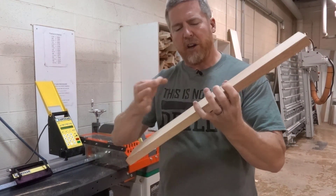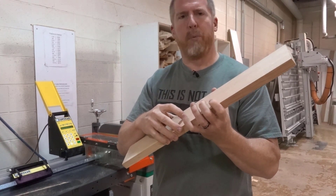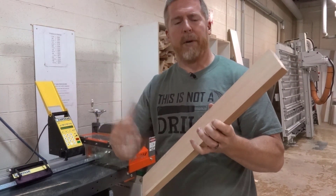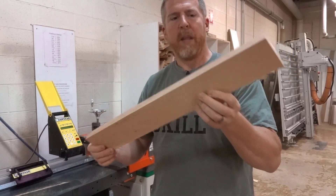If it's got giant knots, it won't be able to bend. That represents a very brittle part — it'll pop out, or it'll shift, or there are cuts in it that as you bend it, it'll want to snap. So try to find boards that don't have any knots in them, no major defects.